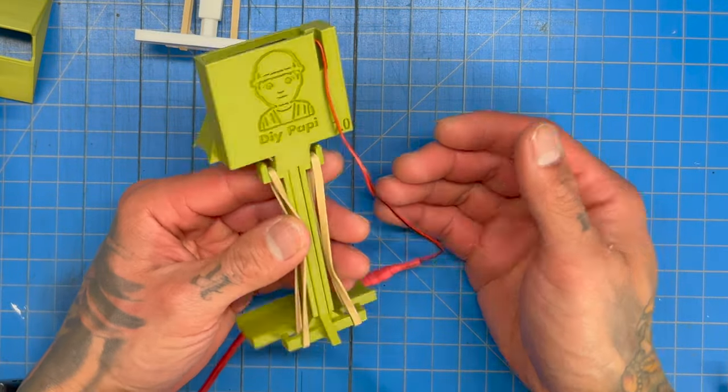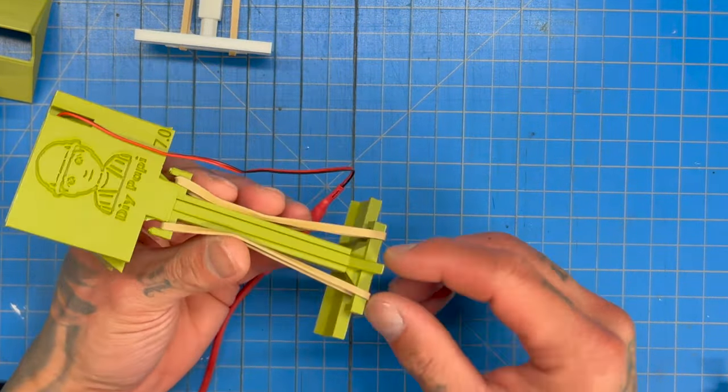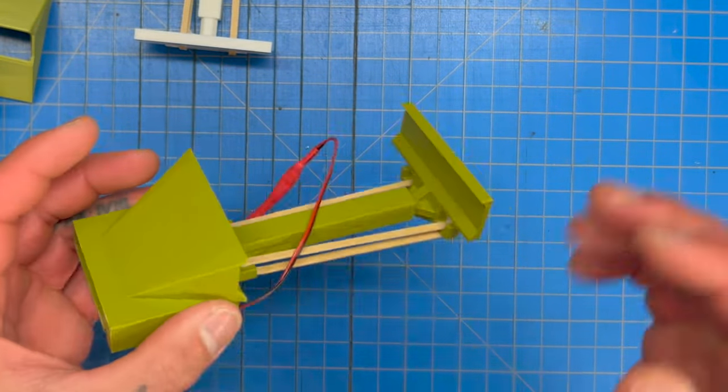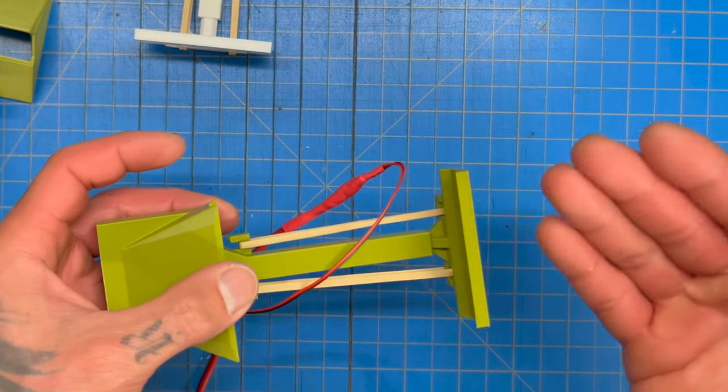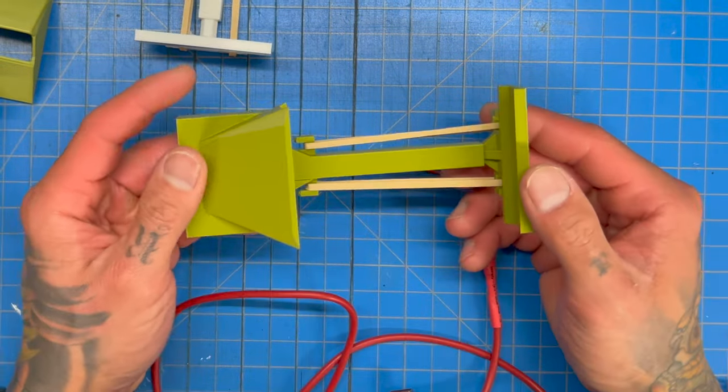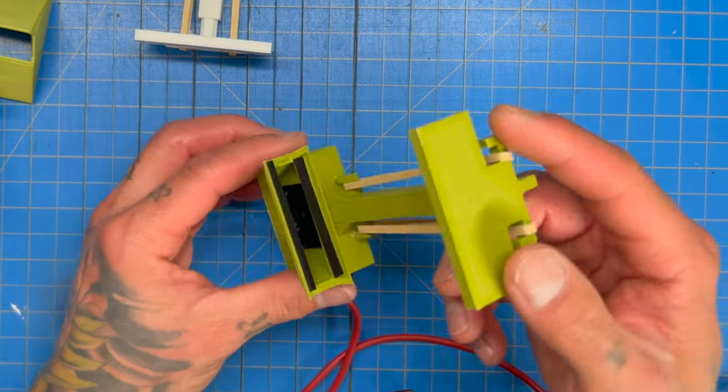Easy ones to point out is we have more triangles right here. It just makes the base more sturdy. Since these two points right here are very far apart, and the further you are away from center of mass, the more likely you are going to hinge and break. Pretty much the same as 5.0, except the mounting is different.